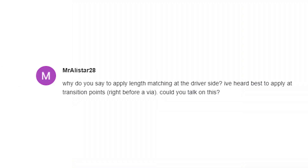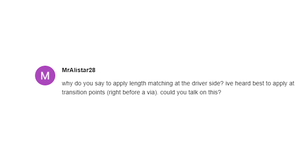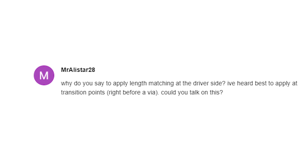So we have two great questions: what happens to the impedance when you apply length matching, and where should you put the length matching section? For Brutwuj, the answer is yes — applying length matching does actually create a discontinuity, and when you have the traces uncoupled in that uncoupled region, there is also a slight impedance discontinuity. For Jim and Alistar, I should put a big asterisk next to my statement about putting it near the driver. The answer is yes, you should put it near the impedance discontinuity or near the length discontinuity, which tends to be near the driver's side in some packages.